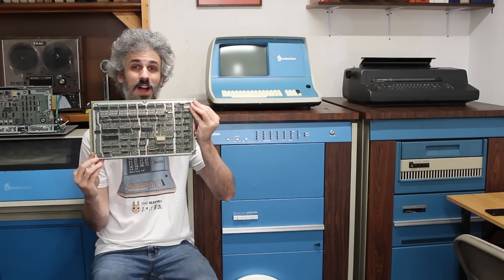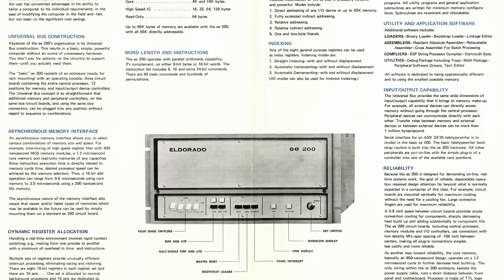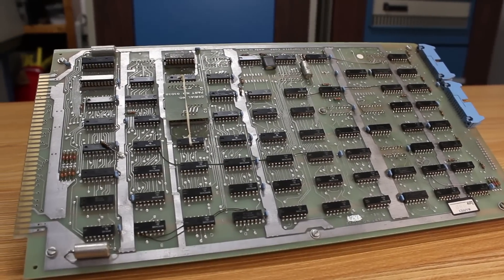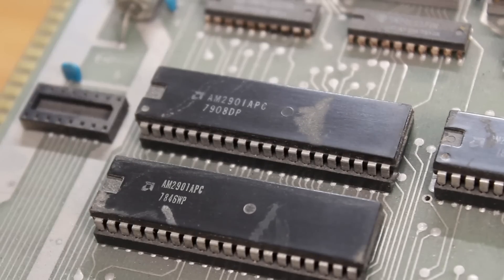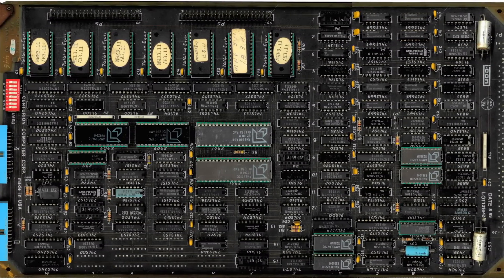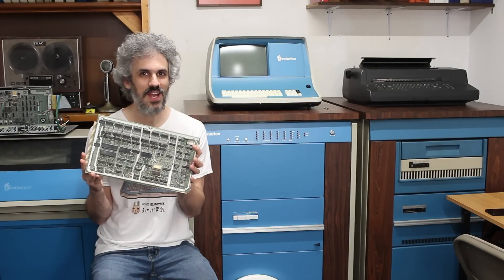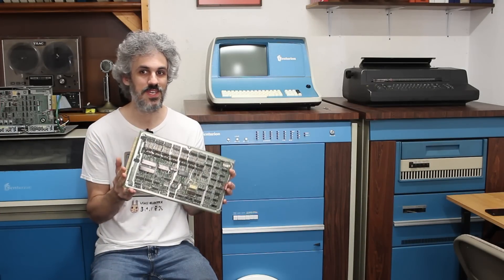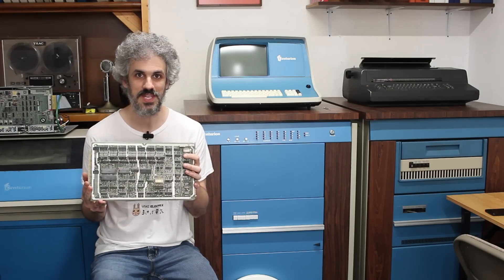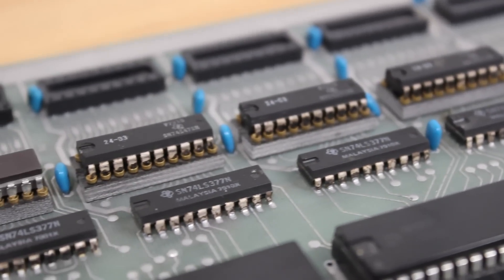Most notably the CPU 5. They had a very basic instruction set that came from the EE200, which was eventually evolved into the CPU 4. Then they created the CPU 5 — an AM2901-based version of the CPU 4 with some DMA operations thrown in. Then they created the CPU 6 which had an instruction set nearly twice as big. So looking at the CPU 5 is like looking back in time at what the Centurion CPU was like before all the new instructions on the CPU 6, and we can get a really close look by pulling all of the code off the microcode ROMs right here.